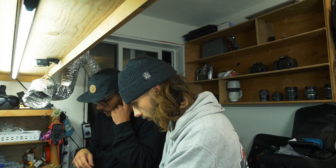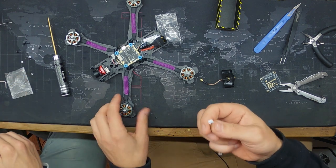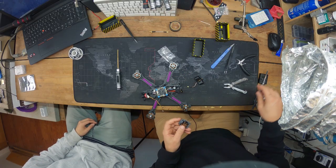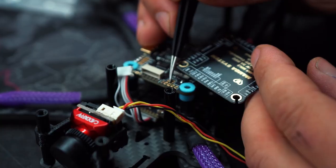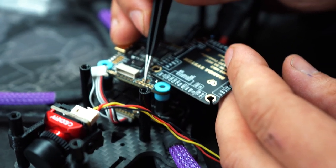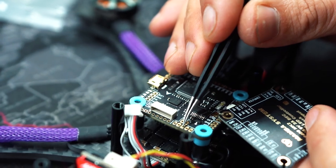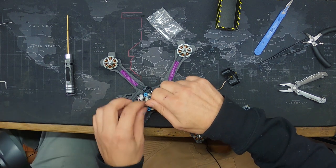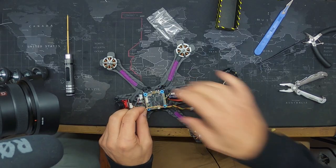Okay, camera's in. Great. So where is the hardware for that bad boy? This gives you a bunch of extra, so that's going to go in there. And then on our pinout, I'm going to point to it so I can have a visual. The square is 5 volt. 5 volt, ground, camera. So we're going to go yellow, black, red, just like it comes out of the camera, actually. That's ideal. I'm going to twist this to make it nice and tight. And then that's probably enough like that, right? We don't want too much. Have enough so you can crank it down to the 50 degree camera slope and just go shred.